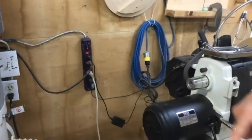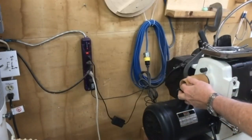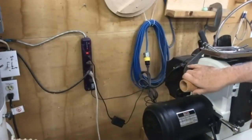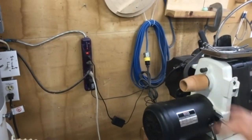You're getting quite a bit of leakage around inside of this thing. And as I say, the next thing I want to talk about a little bit is what that really means. Right. How much leakage you can tolerate. But anyway, it's not a tight fit. It is reasonably tight, but it's not tight like a seal bearing that you'd use on a traditional vacuum chuck.